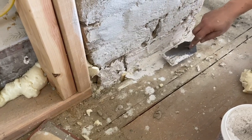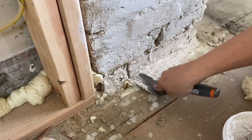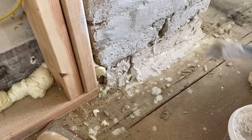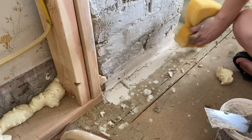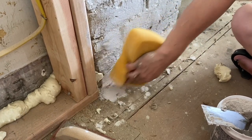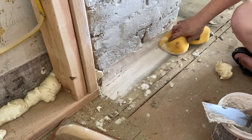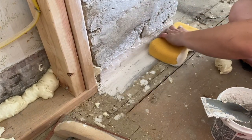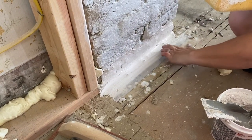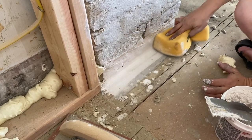Add a little bit of spray foam down underneath here — we're just filling in a crack. It was about an inch wide and it goes straight down to the basement. If you drop something down there, go look for it in the basement, you might find it down there. When we paint the floors it'll just blend right over. The floors go to right here, so this is just a little bit of cement work.